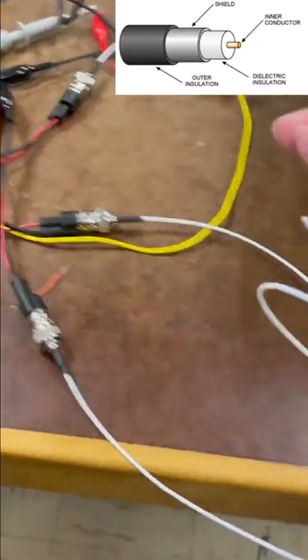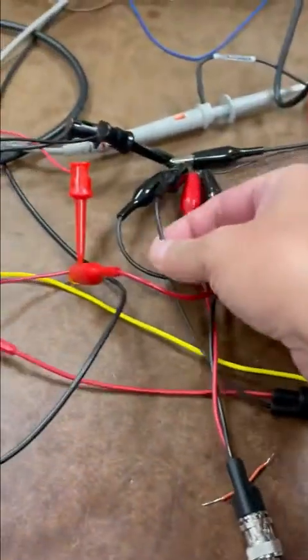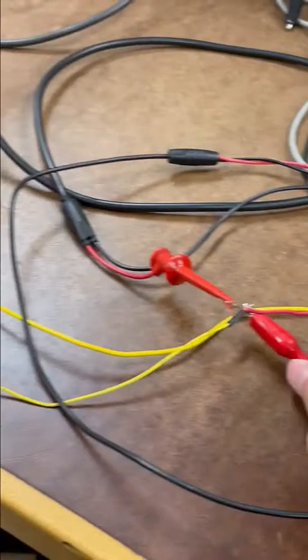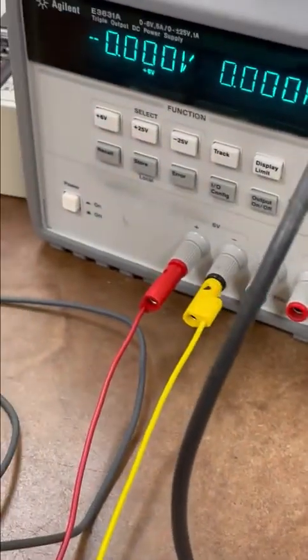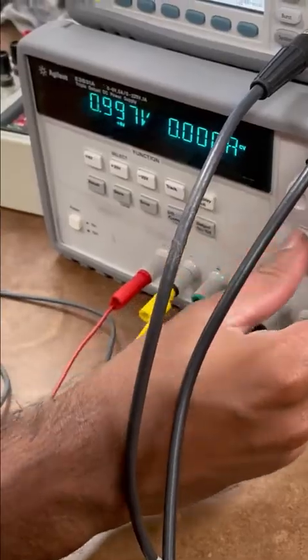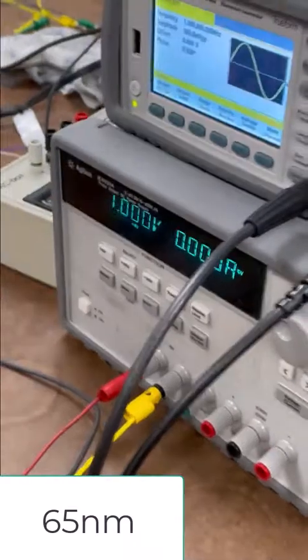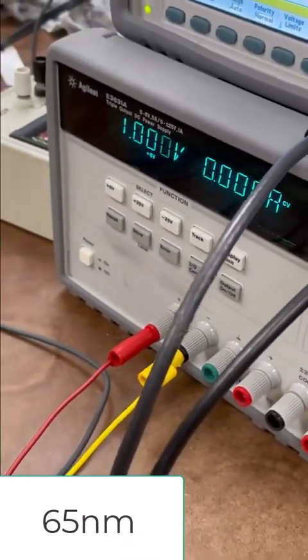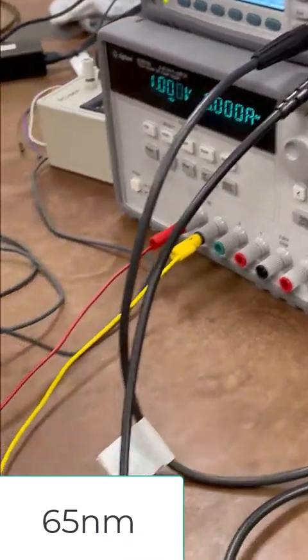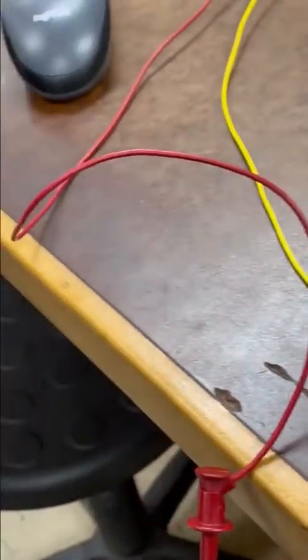This one is to be connected to VDD. The outer shield is connected to ground, and the signal is connected to VDD coming from this voltage generator, so we'll make it one volt. For TSMC 45 nanometer, the VDD is one volt. Ground is already shared by this yellow line — all common ground now.